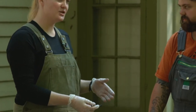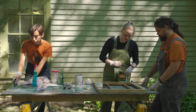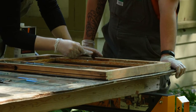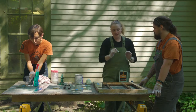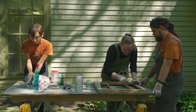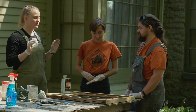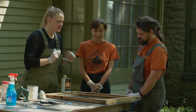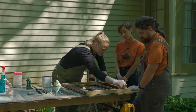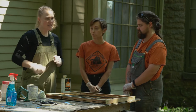The product I'm going to use today is called Flood Penetrol. I'm going in with just a little disposable chip brush and doing a light application around the edge. You're looking for the product to soak into the wood — the wood will sometimes look a little bit darker in color as it becomes more hydrated. After letting the Penetrol sit for a few minutes, dab away any extra that wasn't able to soak in, and then the glazing rabbet should be ready to glaze.